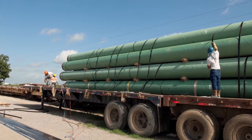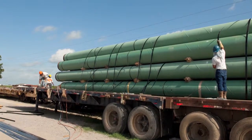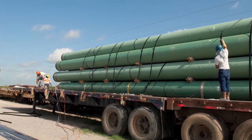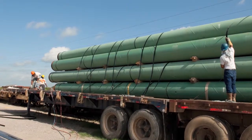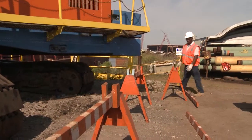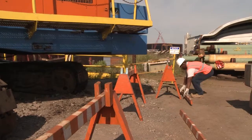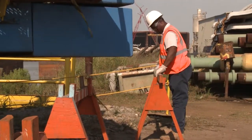When used, we inspect the rigging equipment and straps and remove defective equipment from service. We inspect tag lines and make sure they're the right length, and also make sure there are no knots or defects. We ensure the barricade radius is set up for the swing radius of the equipment, identified by signs and proper roped-off areas.